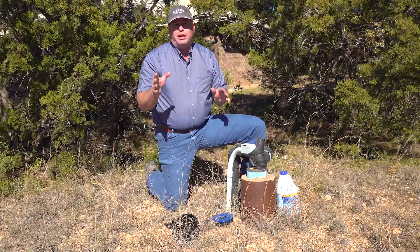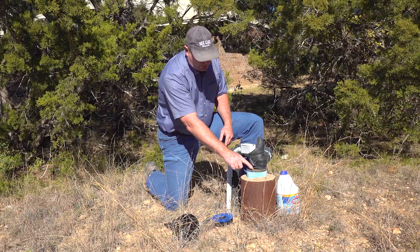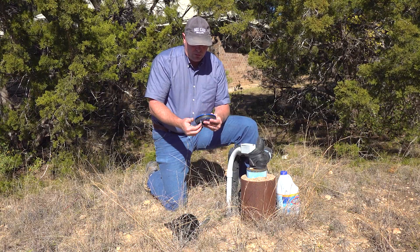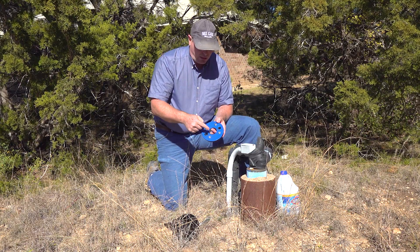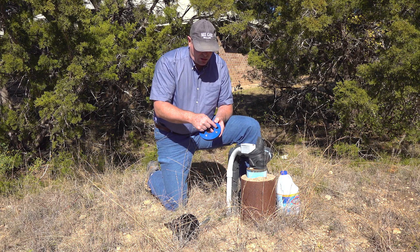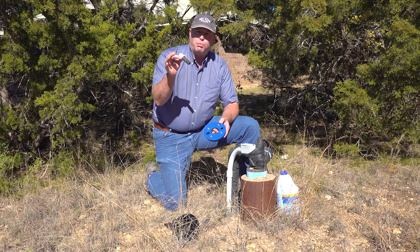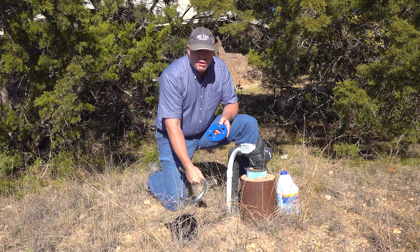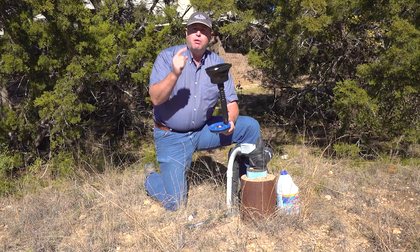It's finally time to start putting our chlorine into our well. If your well head looks like this, then you have what's called a well seal — this plate right here that holds up the pump column. It's a steel plate with rubber between a second plate. You don't need to mess with those bolts. You've got three holes here: usually the main one is for the drop pipe, another one for the electrical wire, and a third one. A lot of times it will have either a blue plug or a vent — either a little plastic vent screwed in, or a big metal candy cane vent. Remove that plug or that vent — that is where you're going to need a funnel to stick in, and that's what we're going to pour our chlorine into.